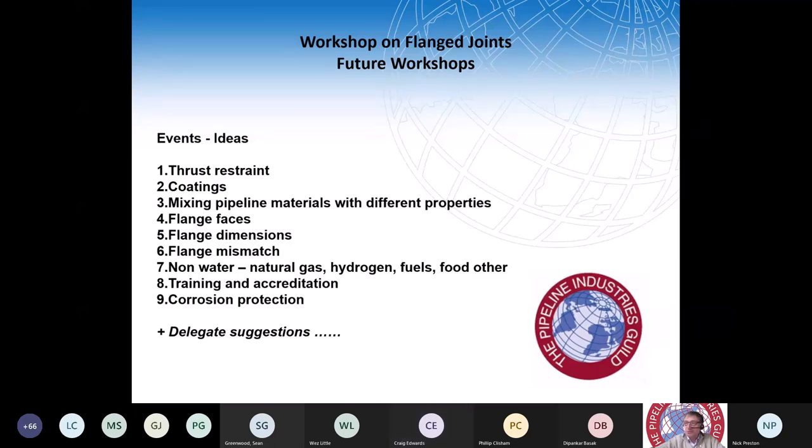When you start to unravel the reasons why, we've unwittingly eroded the factors of safety, sometimes from cost-cutting exercises, sometimes from new standards and new technologies available. A lot of the changes, starting perhaps with not putting flange pipework in chambers, and carrying on with the invention of the raised face flange and new types of coatings, have all eroded the inbuilt factors of safety that used to exist. That might go some way to explaining why we've got an increasing occurrence of failures in the industry.